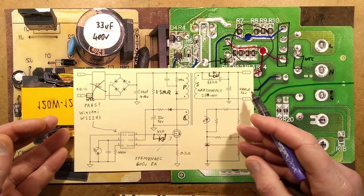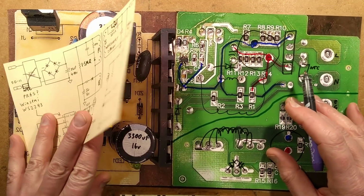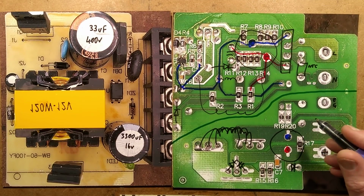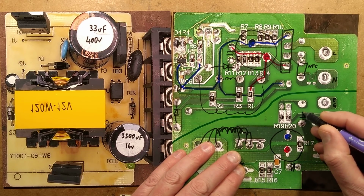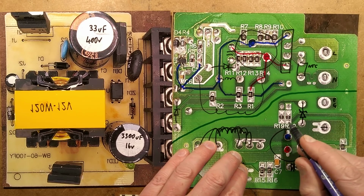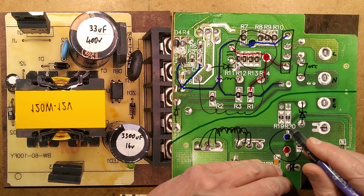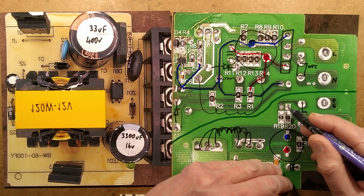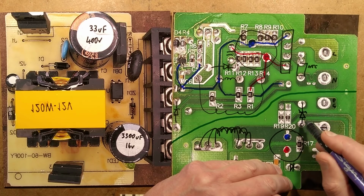But whereas it's quite a complex circuit here based around a voltage reference, probably a TL431 voltage reference, in this case they're not using that. They're using something very simple. They're really just aiming at a rough 12 volts. So they've got this Zener diode here, which is in this location here. And they've got a couple of resistors going from the positive rail. One is going to the opto-isolator, the other one is going to the opto-isolator and then the Zener.